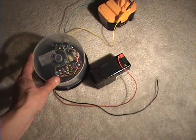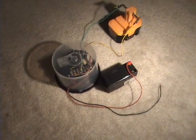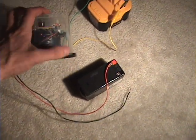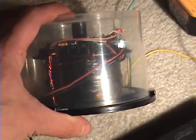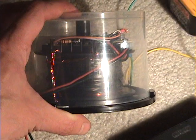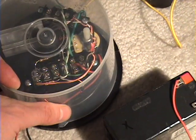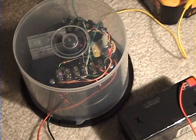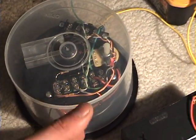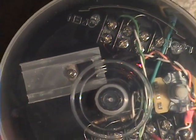I've seen this done before on one of John Bedini's pages, but that's not why I did it. I just wanted to see how compact I could make this coil and circuit, and I was able to fit it into a CD case. There's a quad core coil here with four power wires and then a fifth wire for the trigger. The four power wires together make it much more efficient, and the more strands you have for the power wire the better. You run all the wires parallel — you just wind four wires and tie them at each end. There's actually not a need for four transistors; you just use the one, and it runs all four wires at the same time.